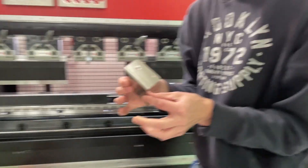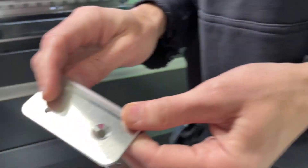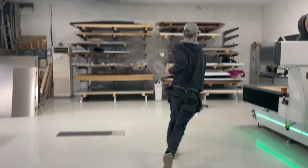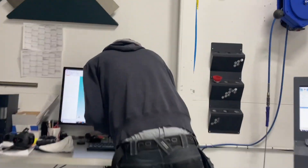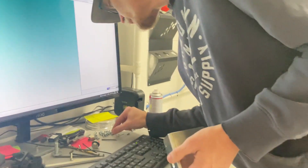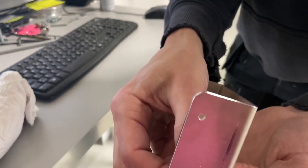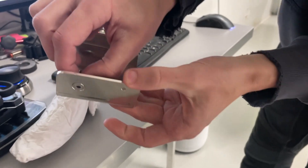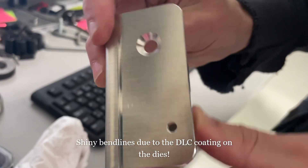So that's our part: it's chamfered, nice and smooth, no cutting edges. It's countersunk, it's an M5 — we take an M5 screw and it fits. That's an M6 countersunk screw — as you can see it's flush and nice. That's the threaded hole — the tap is really nice, clean cut. Very good. Awesome! We need to go. Thank you. Bye bye!